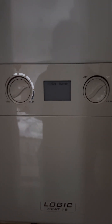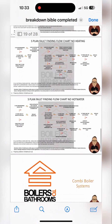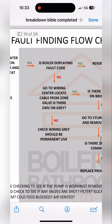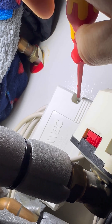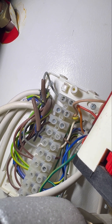Let's go and check the boiler. The boiler doesn't even have a permanent live by the looks of it. Let's whip out the breakdown bible, go down to the S-plan system fault-finding flow chart for no hot water. The programmer display was on but there wasn't anything at the boiler, so I'm going to go to the wiring center.